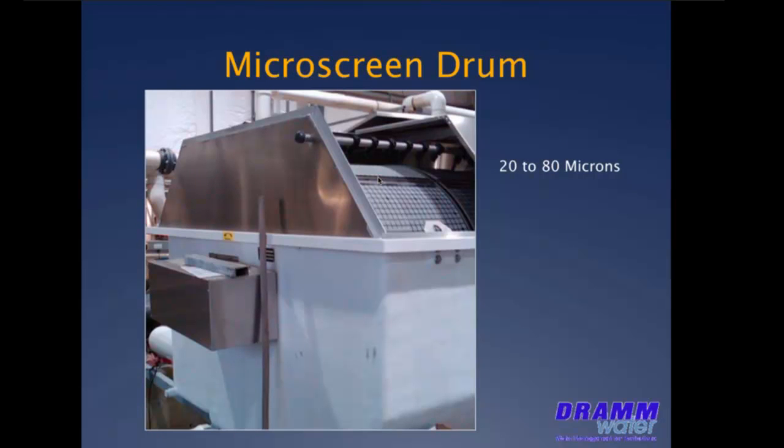Microscreen drum filters are a relative newcomer to the horticulture industry, though they've been used in the fish industry for years. They're replacing a lot of screen and rolling media filters lately. The biggest advantage is that they don't use any media and are very simple to operate. They provide good primary to mid-level filtration with good efficiency as long as you don't overrun them. They are continuously self-cleaning, and the individual screens are easily replaced if damaged. The cons are that they are continuously backwashing, so there's a continuous effluent flow that needs to be treated — you still have to answer where that goes. They work very effectively in flood irrigation recovery and for ground runoff filtration.